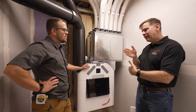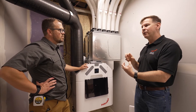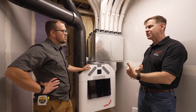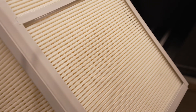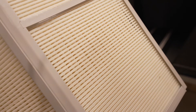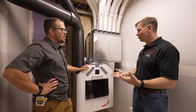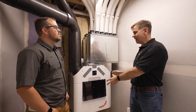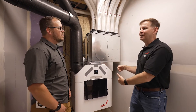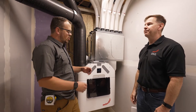The core is a bunch of stacked layers of formed sheets that create channels for air to flow through. The more layers you stack together, the more surface area you provide for heat and humidity exchange. You have to invest some real estate in this footprint to get really high recovery, but it translates to comfort and energy savings.